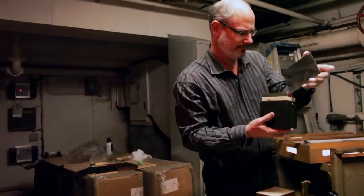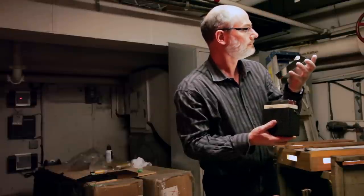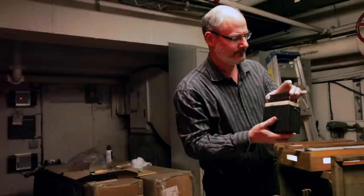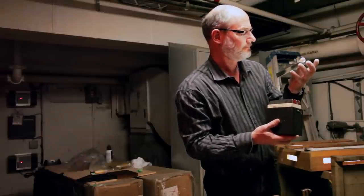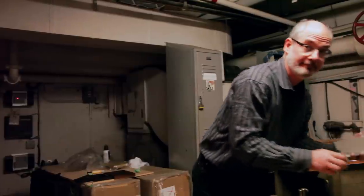These are the plates. It's silver bonded to copper, silver clad copper. They're made the way they were made in the 19th century, where silver and copper are heated to just cooler than the melting point and rolled through rollers and passed back and forth. So this is called a clad silver plate. Every plate here I've worked about an hour and a half on back in Toronto.